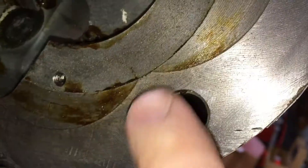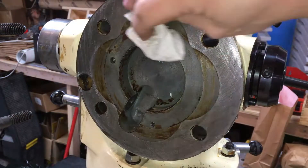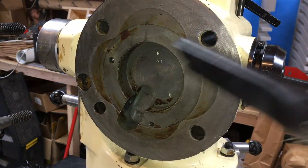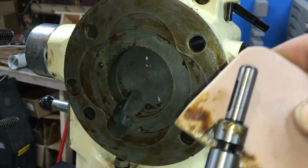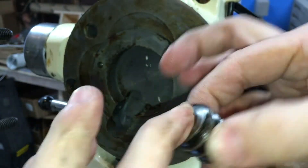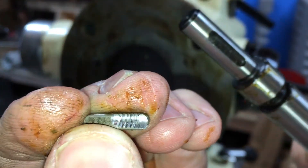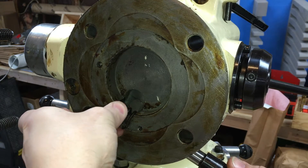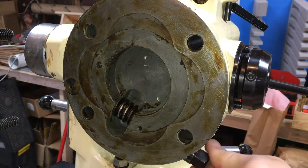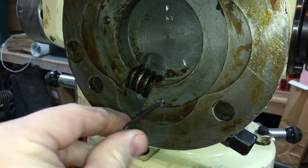It was time to put everything back together. First I filed down a couple of high spots on the flange that got there from swinging the hammer around, and applied back the original grease — or at least what was left of it. I'm reusing the original drilled and tapped key for this shaft, and an extra grub set screw is added.